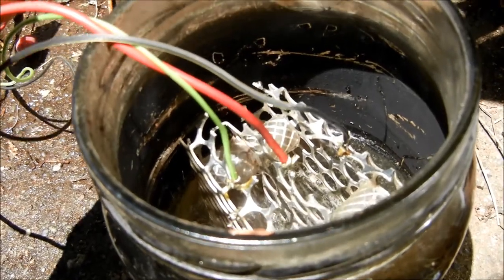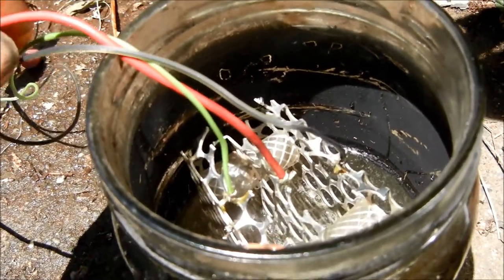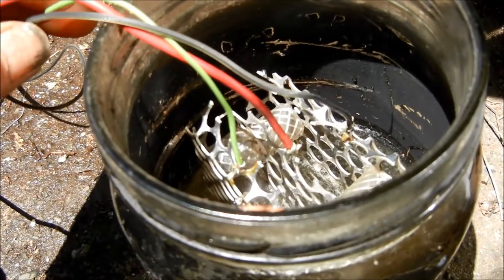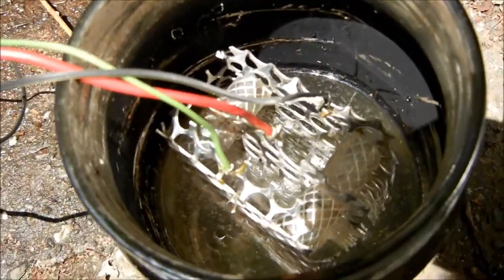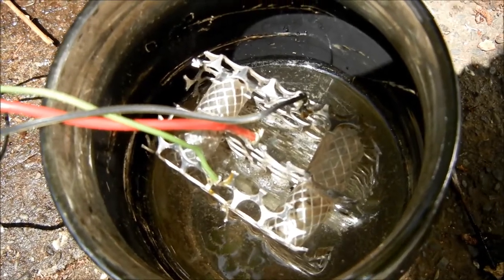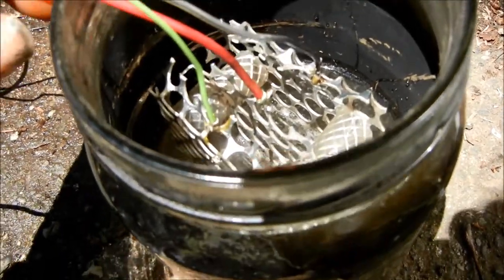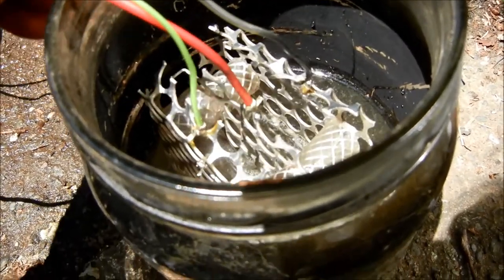The positive is on the outside, which is exactly opposite of what I originally tried. I thought having the positive on the inside would be better, but it doesn't generate as much HHO — hybrid hydrogen oxygen gas — with the positive in the center. So I swapped it around: now I have the negative pole in the center and the positive on the outside.